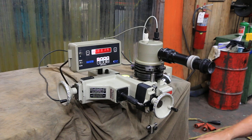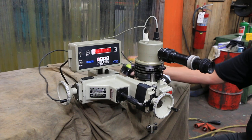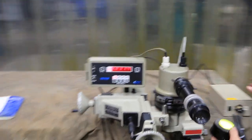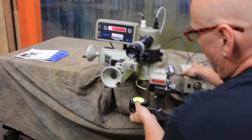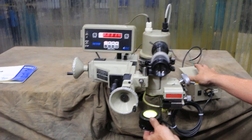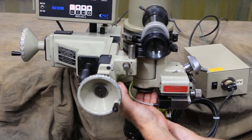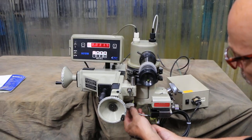The whole idea is that you can watch this little diamond down here through a microscope that goes up through this column. The light source would be mounted below the grinding wheel on your table or on your magnet, and there's a little protective door here that slides open.